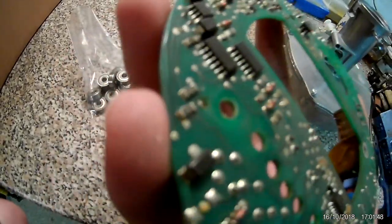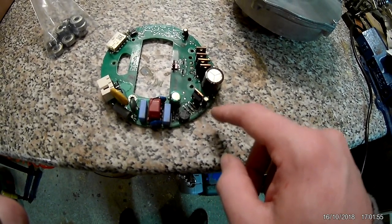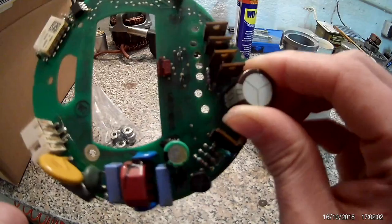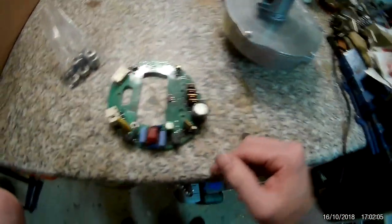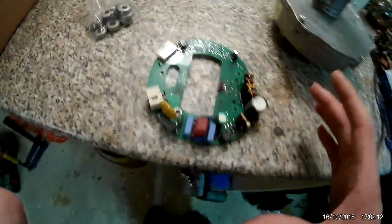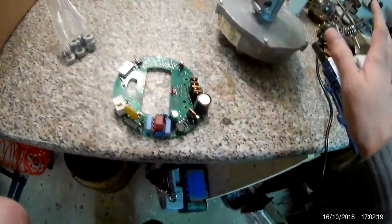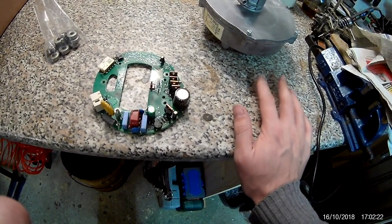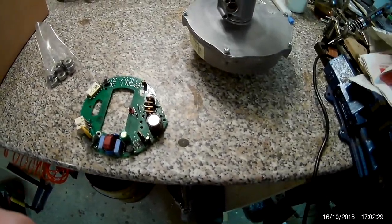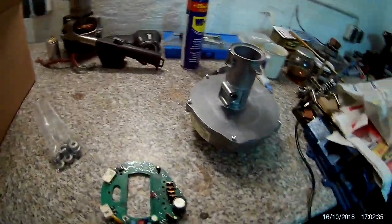I don't know what this cap does here — it has a different voltage. I guess that's a voltage regulator maybe. That's a polyfuse, and that might be an inductor. Somehow they get a low voltage out of it for the control circuitry, which there is a lot of. Also, it's conformally coated so it's hard to see the numbers on the chips. The parts up here are conformally coated — not as much as I expected. Why are those MOSFETs coated and the capacitor isn't? Oh well.